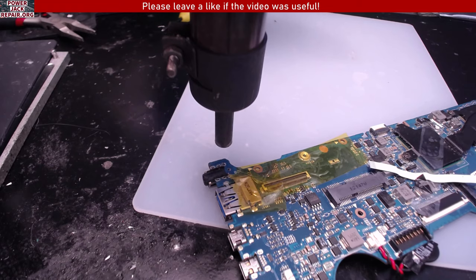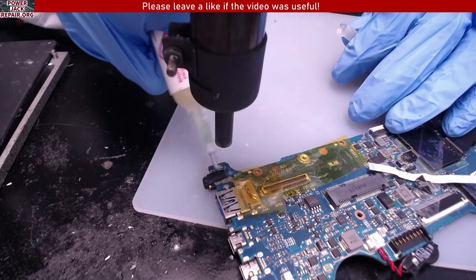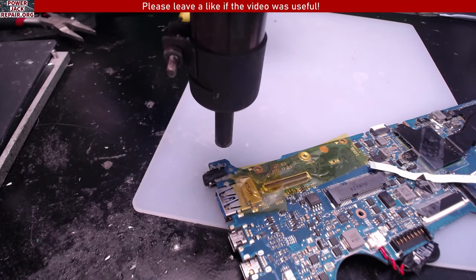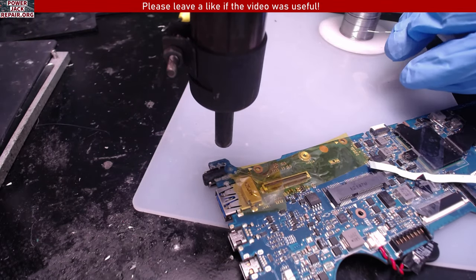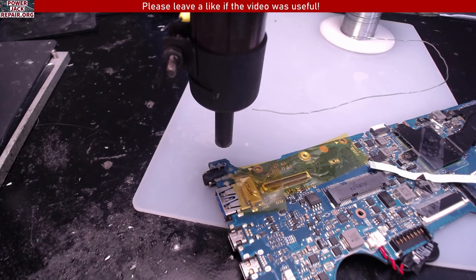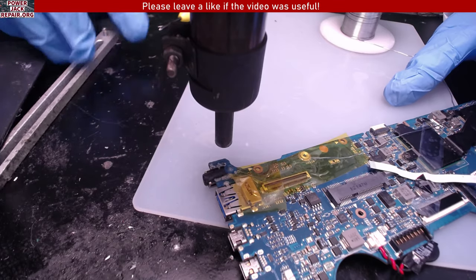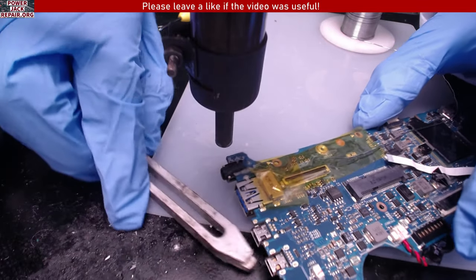Here is basically the proper way to desolder this jack. What you want to do is add a whole bunch of flux — flux is the key. If you don't add enough flux, nothing is going to come out of it. After that you want to add solder, and you'd say 'no' — but I'd say yes, because I've done tens of thousands, if not a hundred thousand, jack replacements in my life and I know exactly what I'm doing. Just follow what the guy with 1000 plus videos on YouTube about power jack replacement tells you.